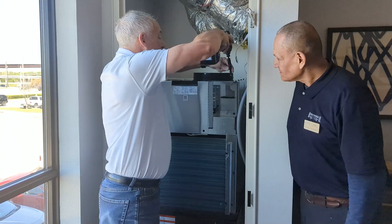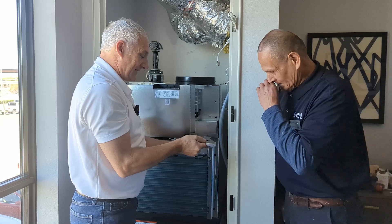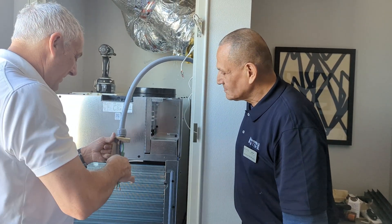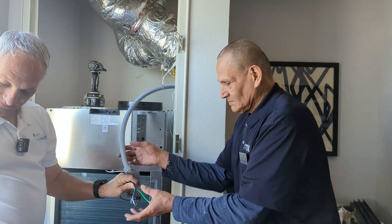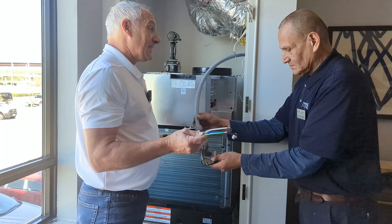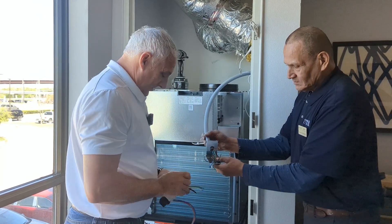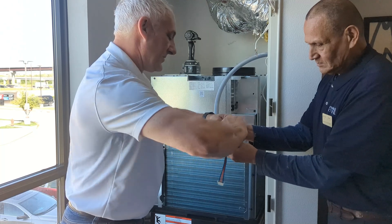We're going to hook up our electrical. We've got a quick disconnect — we'll remove that screw and take this entire assembly out so we've got plenty of room to work. Of course we've got our voltage off with lockout/tagout applied. We need to run our wires through this strain relief here. It's another quick disconnect power connection. The Zoneline has a universal heater — you don't have to choose between a 2.4, 3.4, or 5 kW separately; the power connector and the personality plug determine how much of the universal heater is applied. We'll put our wires together and get them nice and tight.